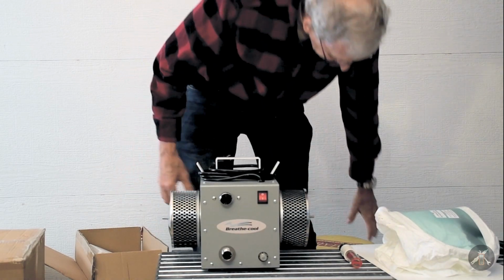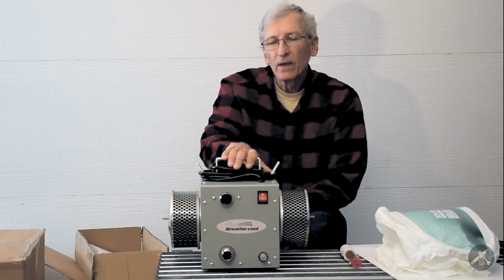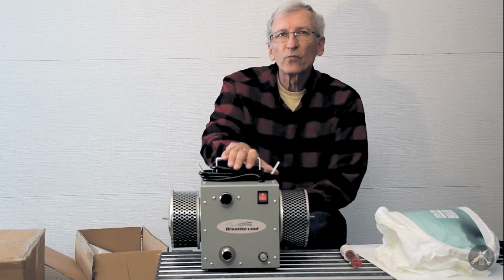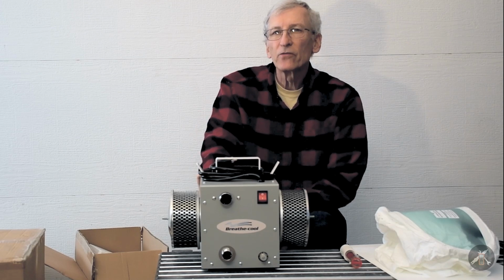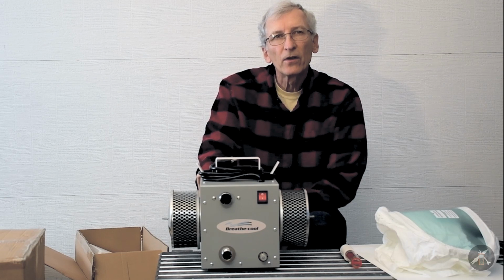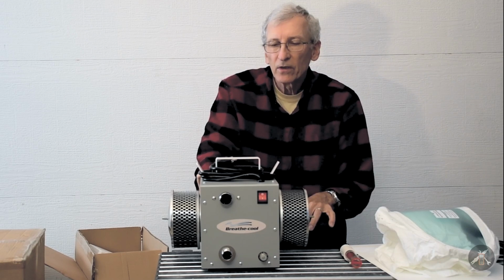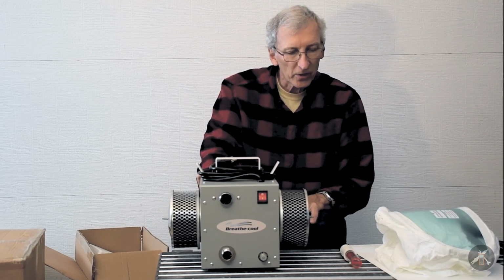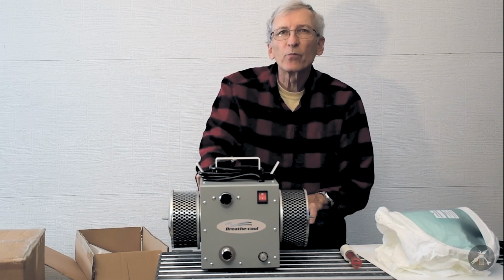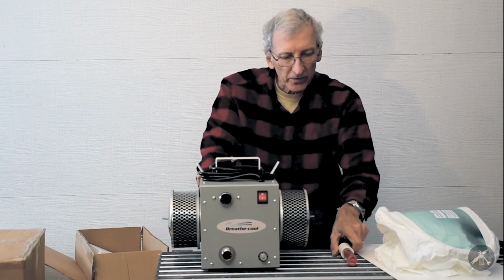And frankly, as I've been working on things recently, I found more and more chemicals, more and more glues. I was using a two-part adhesive not too long ago on some plastic pieces on the car, and even the two-part adhesive recommends an air-supplied respirator. And you know, for years I've just been using charcoal canisters, but I figured it was probably time.